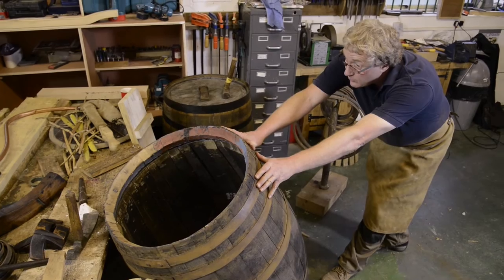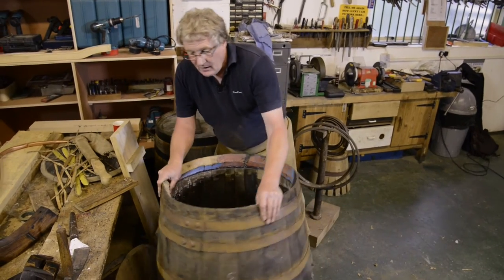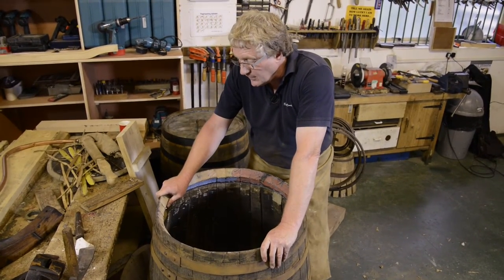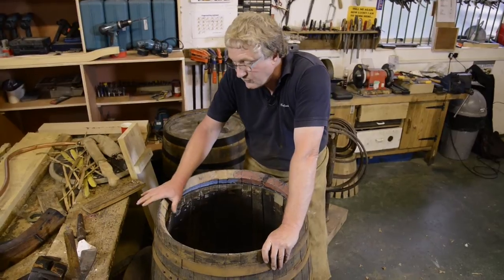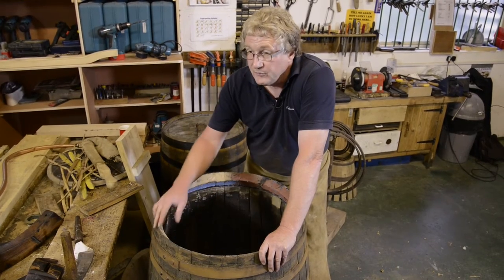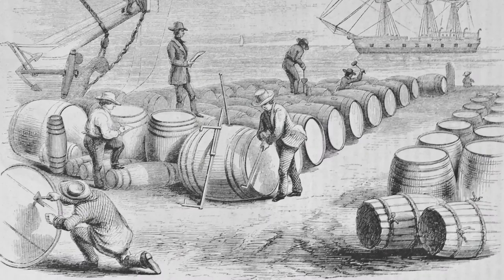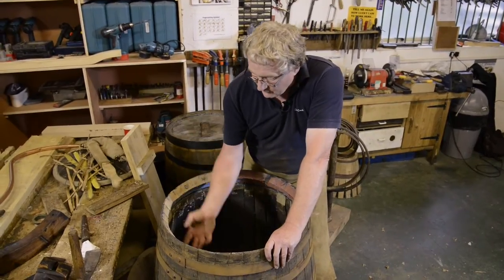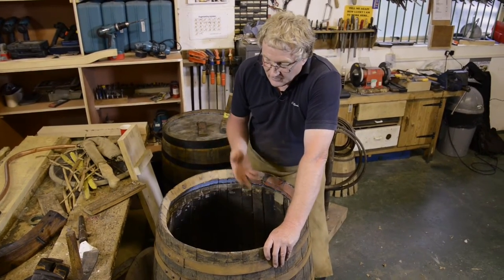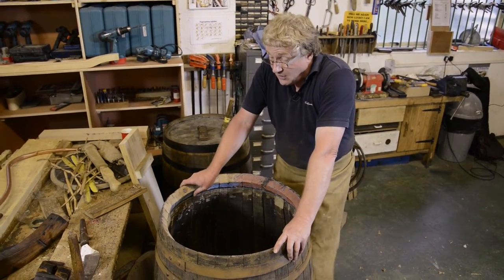You may be wondering why we actually put a chamfer on the end of the staves. It's down to a couple of reasons, but the main reason is to ensure that you've got the least amount of timber coming in contact with the floor — in effect, you're lifting the cask off the floor. If there's any moisture on the floor, it could get sucked up into the end grain through capillary action, and dirty water could get sucked into the cask, become stale and foul, and then whatever you've got in the cask will go off.